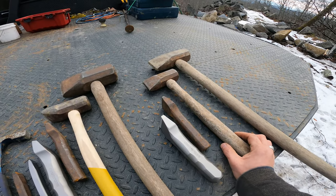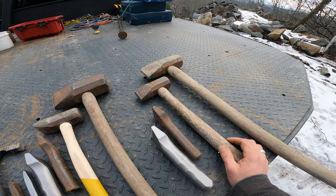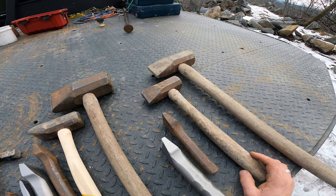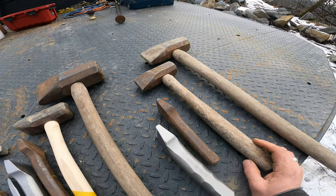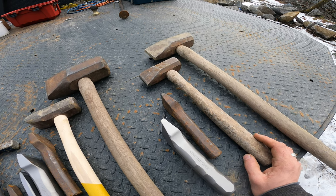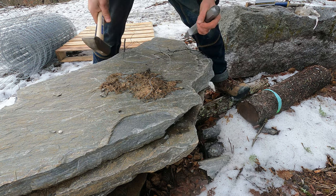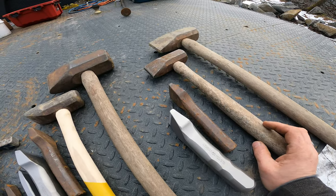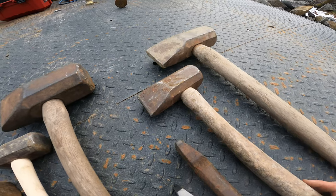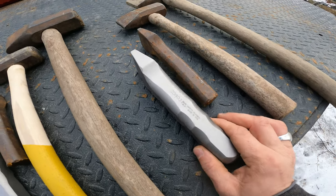Like when we looked at the Athenaeum — they had marginal drafts to establish that perimeter — what I'm doing most of the time is just pitching the face to get that perimeter. These also work really well on patio work because they get a hold of the stone well; I can deliver a big blow, knock off a big chunk, get a big back cut, and then it's easier to shape the edge. The eight-pound hammer is for big blocks, the four-pound for smaller pieces, and hand tools for even smaller still.